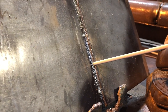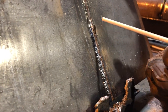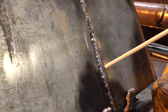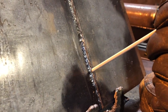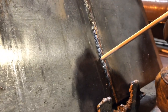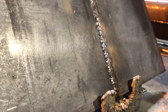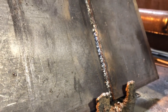I grew up in the day where all the books said to do this motion and point the rod way up. It just doesn't work. A lot of times if someone is struggling, I'll take them over to a MIG machine — because it has no flux or anything around it — and I'll do the same technique, making them watch the pool only, down below the wire. Then it makes sense to them, and they come right back over to the stick and pretty much nail it.